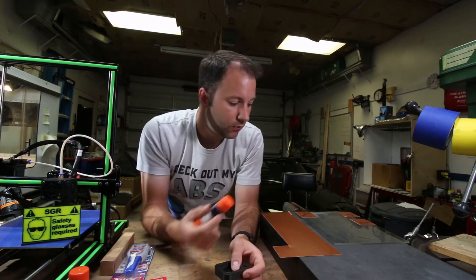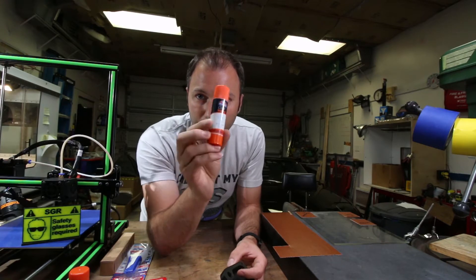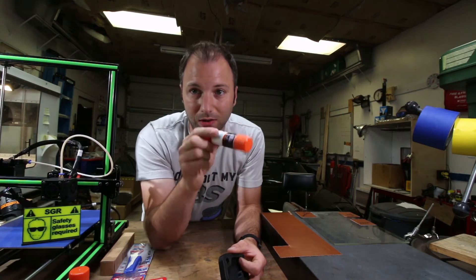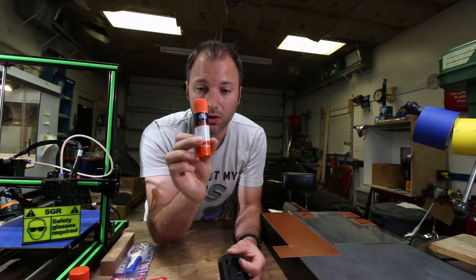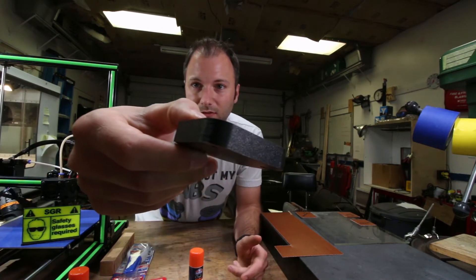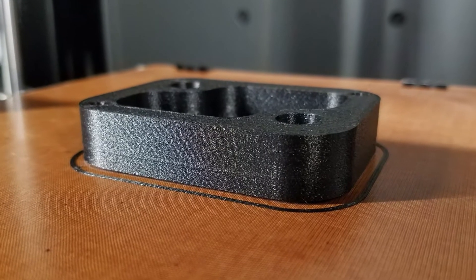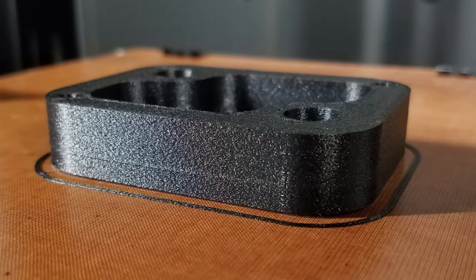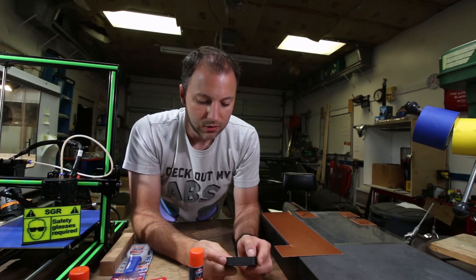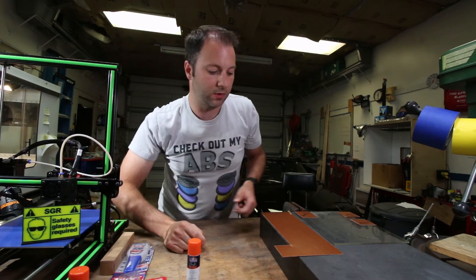So if you have a borosilicate glass plate on your bed and you've got access to a craft store, you can pick up this Craft Bond. I don't think it was hardly any more expensive — less than five bucks, I believe. I'll put a link below where you can purchase this. In general, I'm really pleased with how nylon acts when printed. It has a very clean surface, and the texture of it makes the layer lines really disappear. It almost looks more like an injection molded part, especially in the Z axis.